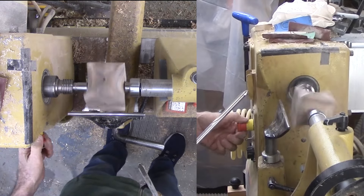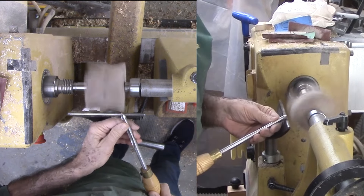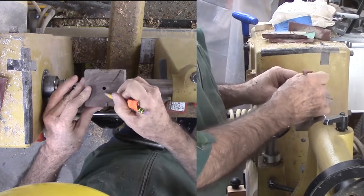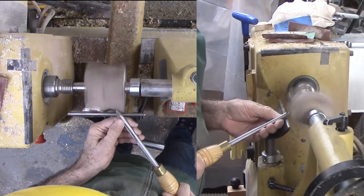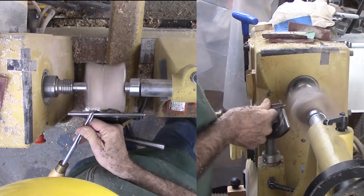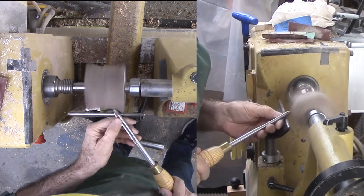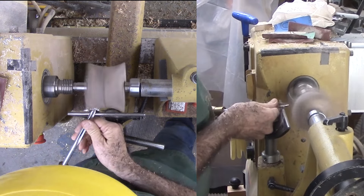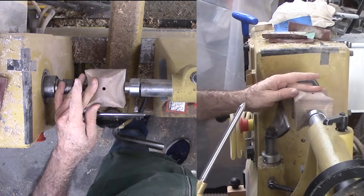After changing the mount to another set of holes, I can start cutting on the second axis. This is the same cove, except that the corners are even more fragile and the backside chipping has increased due to grain orientation. I am finding that the best cut is a shear cut rather than a bevel-riding cut. With the shear cut, the cutting edge is more vertical relative to the spinning wood. Less wood is removed with each cut, but this is offset by less chipping.